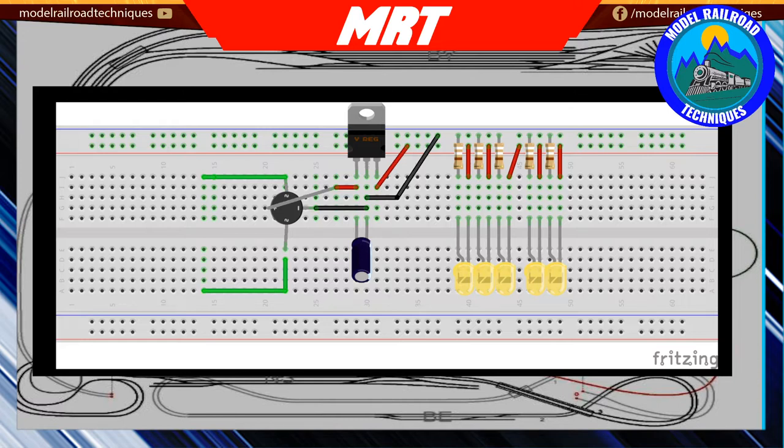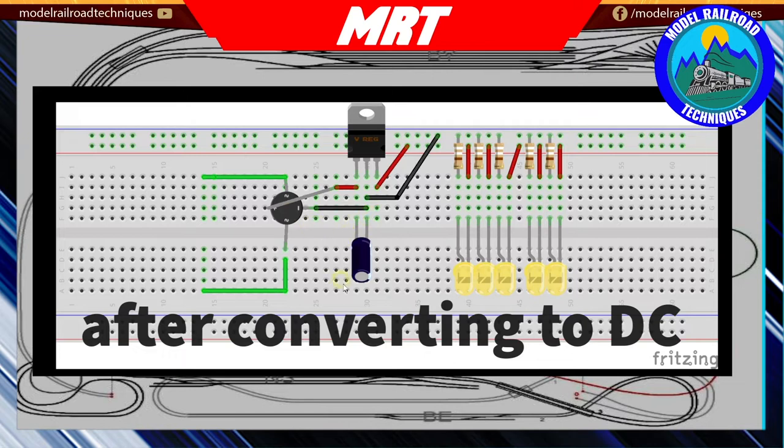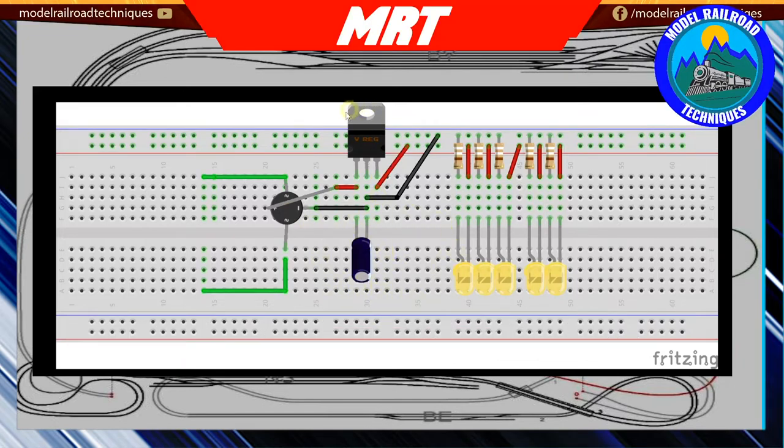A very quick overview of how this circuit works: we go through the bridge rectifier here, with DCC coming in on both sides. We're looking at about 12 to 14 volts depending on which scale you're running. That then charges up the capacitor which powers the 5 volt voltage regulator, giving us a constant 5 volt output. When there's a loss of power from dirty track or pickups, the capacitor continues to maintain that constant 5 volts to keep our LEDs lit.